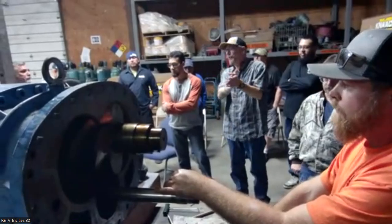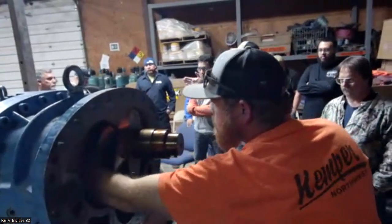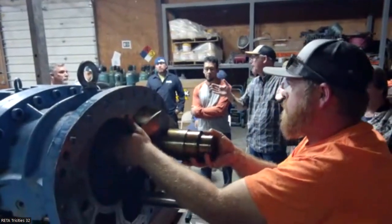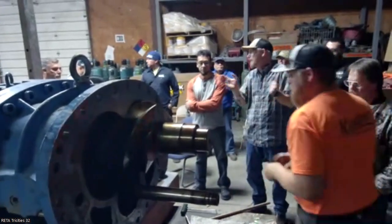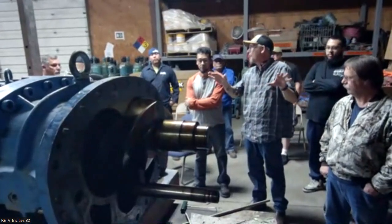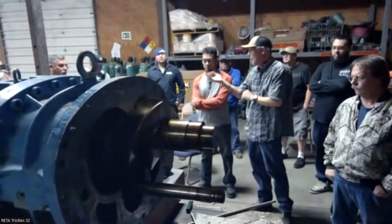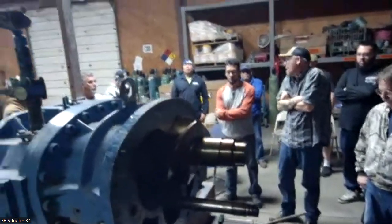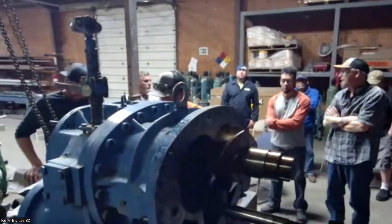Of course, we make a change in our process a month after we have our annual done. Yep. I've got 11 months of that machine possibly operating in critical speed where it shouldn't be, or whatever the situation is, to say, let's tune that out of our refrigeration controls. So other things, like you were saying, oil contamination, and it starts and stops, that's the thing.